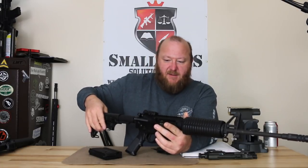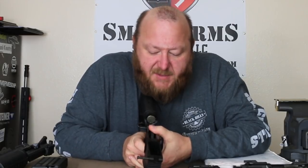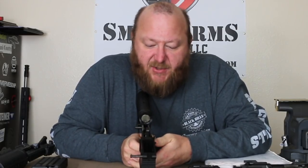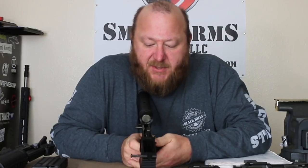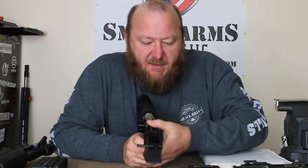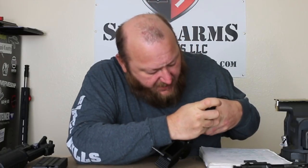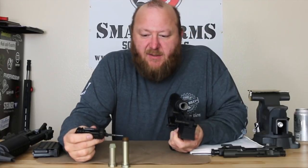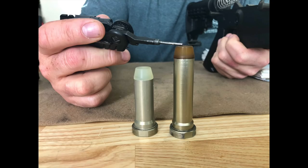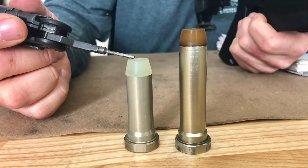So now we're going to go inside and take a look. The first thing we're going to look at is the trigger mechanism. This particular rifle comes with a standard mil-spec trigger mechanism — this broke right at 7.25 pounds on my military scale weights. Now we're going to talk a little bit more about the buffer. Here we have a standard mil-spec buffer; this particular one is an H, with two steel and one tungsten weight slug in it, and this is the modified one for the .308.